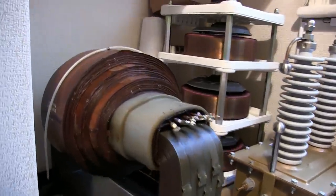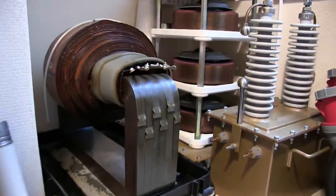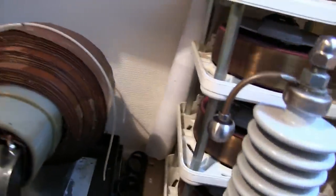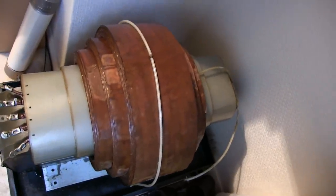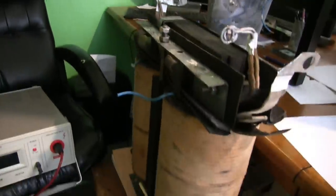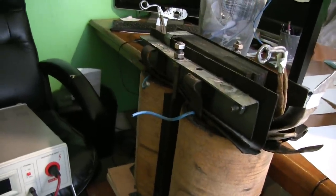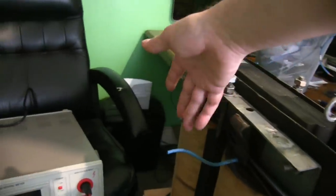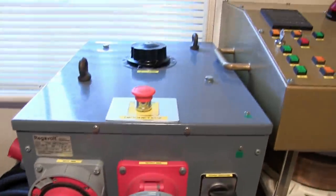As I said, you've got this high voltage transformer. This one's a little bit more special — it's so powerful the voltage is astronomic; it's going to make this one look like a spark on an electric cooker. But we need to get a four-foot bushing for it. We're going to end up with about 600kV DC with that one — it needs a box and a bit of work and a bit more money unfortunately. But these other transformers are all useful — they've got their uses for different things, mainly destroying things, but very handy once you've got a variable transformer and a stack of others.